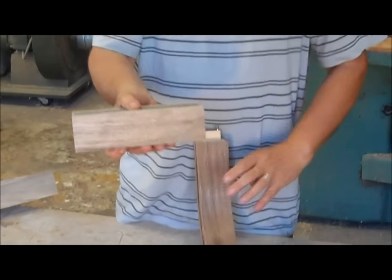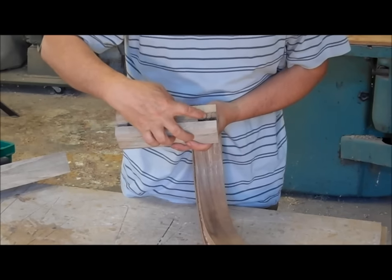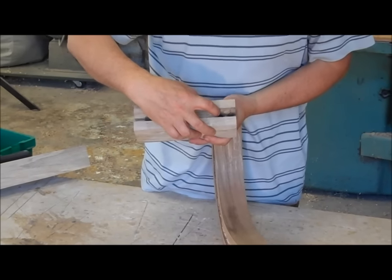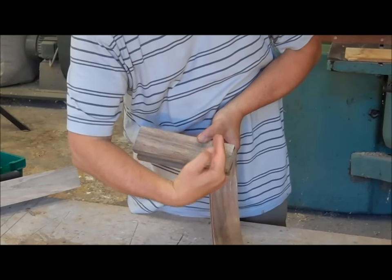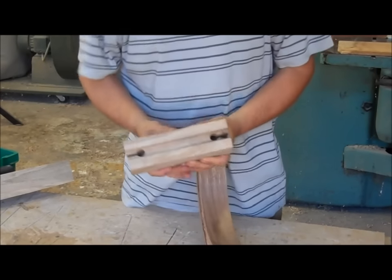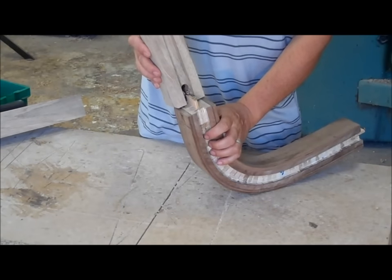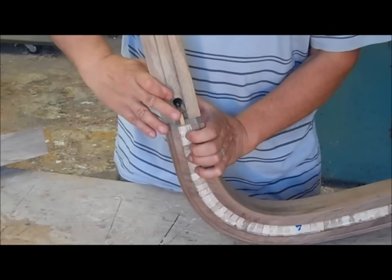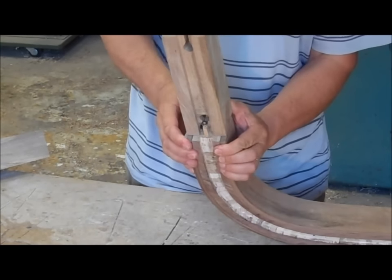The head of the screws are longer and wider than the actual tenon. In the straight part of the rail I have drilled a hole underneath the rail here. This hole is going to receive the heads of the screws, and the hole is slanted in the rail. So as the joint slides in place, the screws will pull into the hole and pull the joint tight.